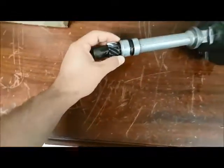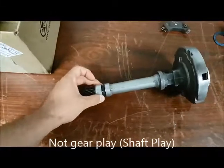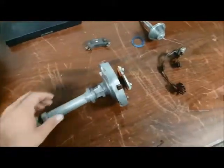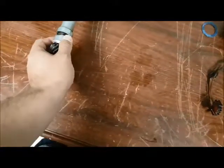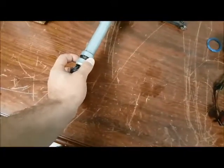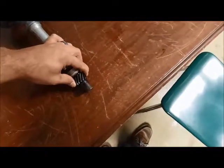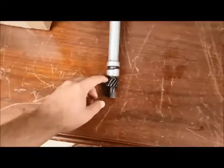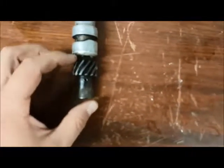What I was trying to say is this gear right here has a lot of play in it. From reading online, people were saying it should have between 10 and 20 thousandths of movement — and that's basically what you want for expansion and things of that sort. I put it on my feeler gauge and it was 70 thousandths. So I'm going to get some shims — the shims will go in here and you'll shim it so that the gear gets pressed down. It just needs that.